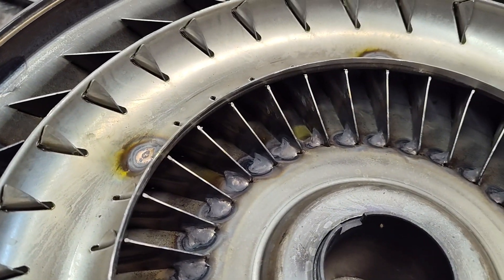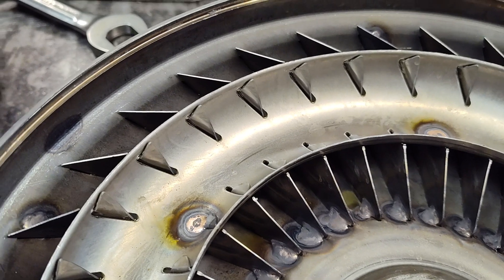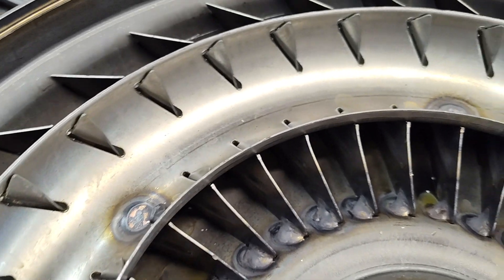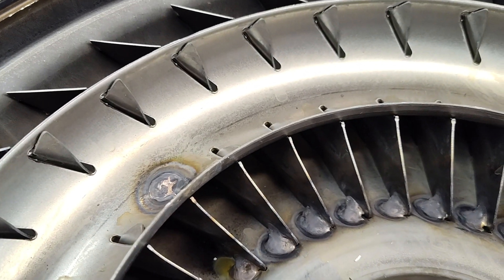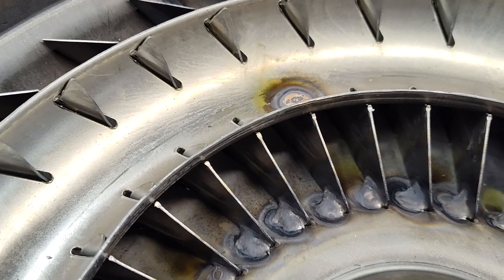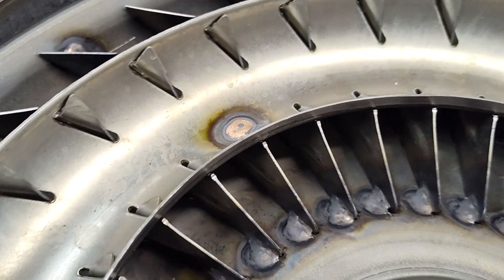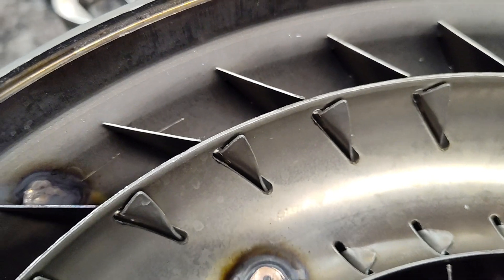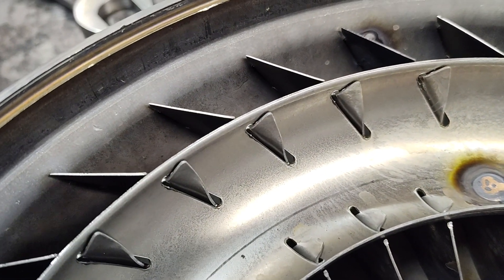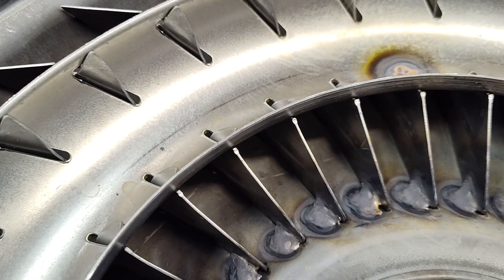You can take a better look at it. The more power it is, the more you're going to weld it, and the longer the welds get. But for this, this is going to be much better than factory. I welded all of this on the bottom here where you see all these small welds — this is all for the intake of the pump, as they call it. And then out here in the fins, I just weld every so often on those. There's not as much tendency for these outer fins to get folded as there is on these inner ones.